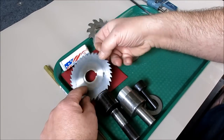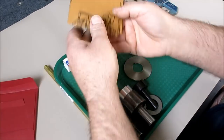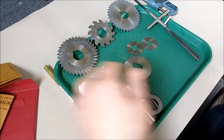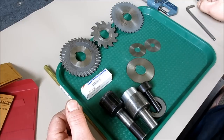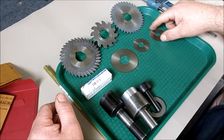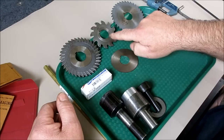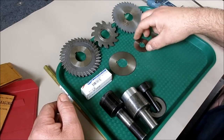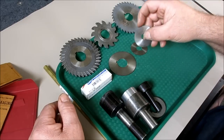Here's a brand new one — this is a milling cutter. So there are the different types. We have slitting saws, we have side milling cutters. This is also a slitting saw — a carbide tip. This is a screw slotting saw, and then these are jeweler's saws — characterized by the very fine teeth that they have.